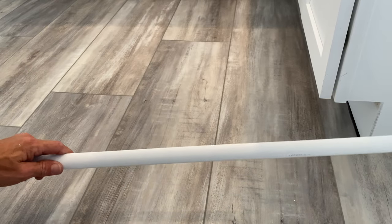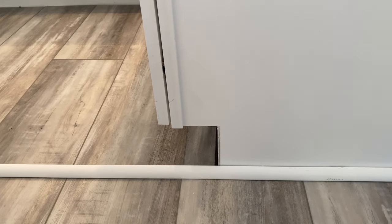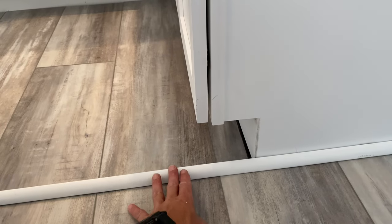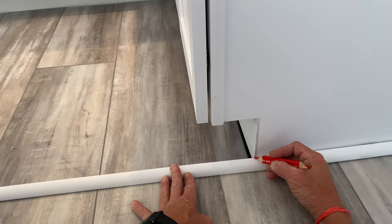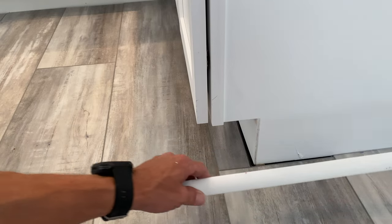There's our inside 45. I'm going to go ahead and push it up to where it's got to go — it needs to be cut back a little bit. There's a little piece of trim in this corner, so we're going to make that just a little bit tighter. Push that into the corner so it's nice and tight. I'm going to take my pencil and come on the back side of this quarter round — just make sure you've got it nice and tight to the opposite corner — and then mark a little bitty mark right at the top right where your inside cut will need to end.